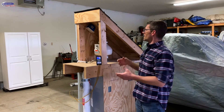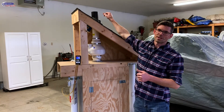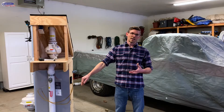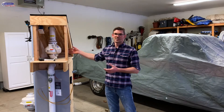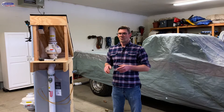The answer is no. You do not need to have a cap on the top of the radon system, and it's preferred that you do not. It's all pitched to allow water or condensation to drain back to the suction point or suction points that you have. The radon fans are designed to deal with water and they can handle a little bit of water that runs through them.